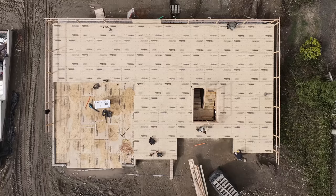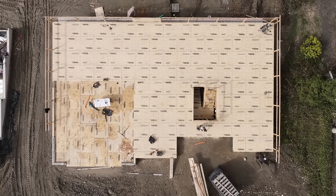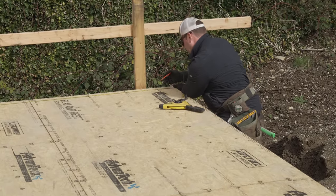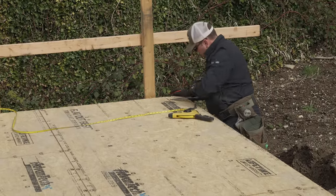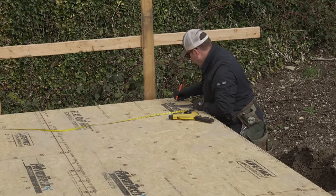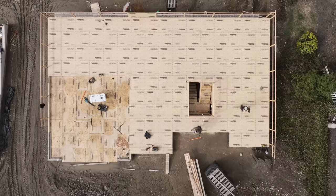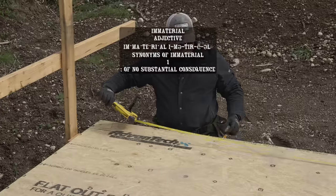Okay, 35 foot, 7 2. I'm gonna try to not fall off this bank. 35, 7 2. You good? 35, 7 2. We're like 5 5. So I'm just gonna shift that one back just a hair. Okay, then let's pull this way. Our goal is that if we have any adjustments to make, that they are always less than 1/4. It's immaterial.